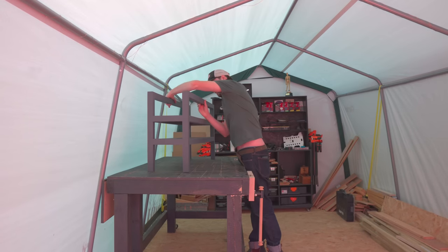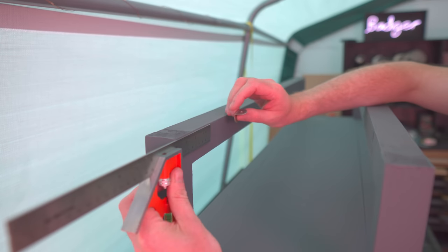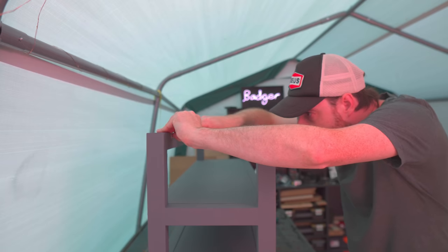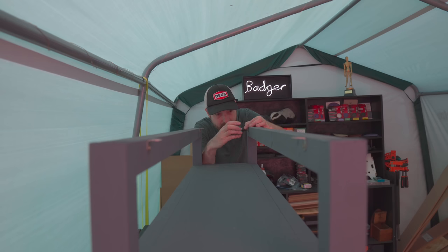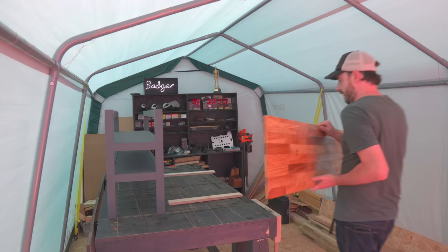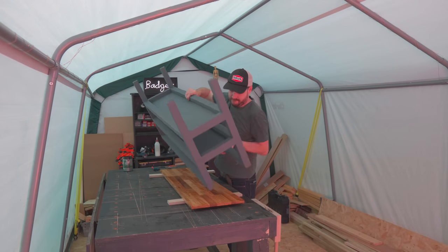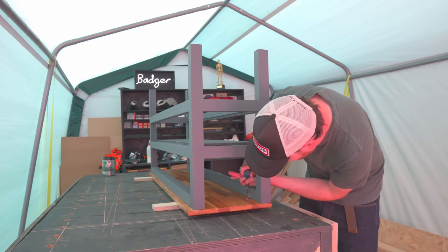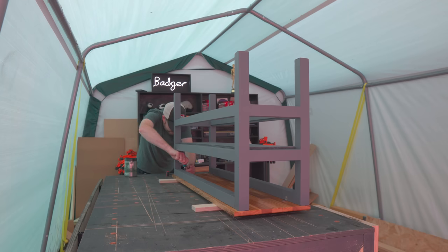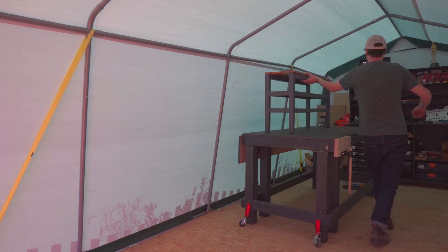When the oil has had a chance to dry, I need to get the top actually attached, and what I'm going to use is little L-shaped brackets. I get them screwed onto the base. Now instead of attaching the top to the base, I'm going to attach the base to the top — I suppose it doesn't really matter — so I flip it all upside down and do it that way. Whilst I have it upside down, I'm just going to add some rubber feet — these were left over from when I built the garden table, so just one screw attaches them.